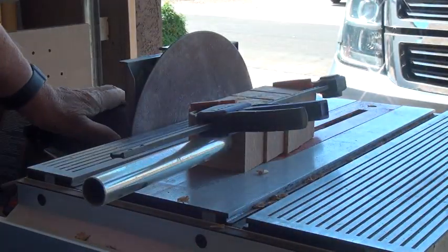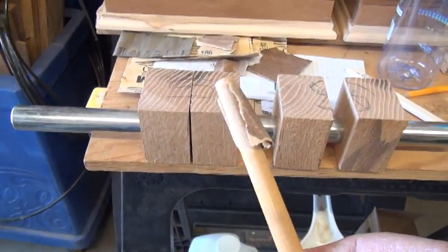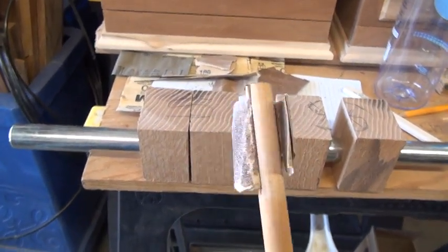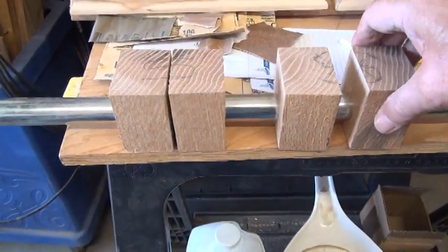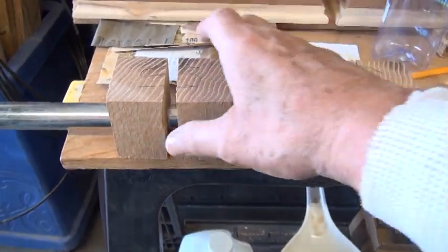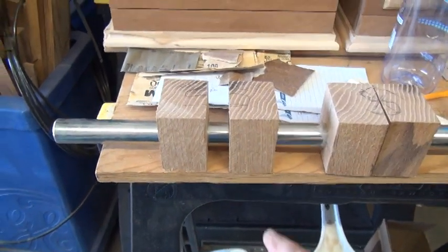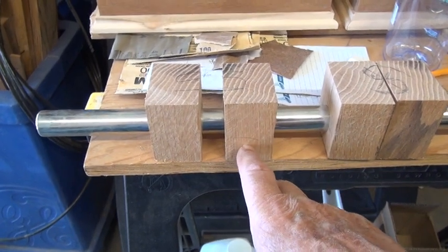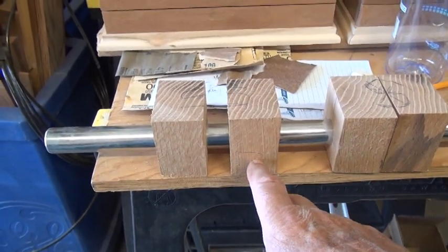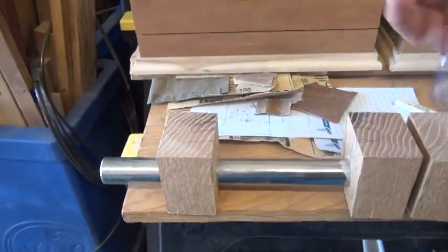Get rid of all this safety stuff. Okay, I've got them paired up, and I took a dowel and split it and put some 60 grit sandpaper in it and went through with a drill, and I opened them up so they slide easily now. And what I'll do next is I'll probably drill a hole and then thread it so I can put a lock in there so I can secure them once they're set, because they're going to be 7 inches apart basically.